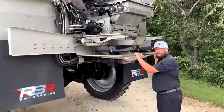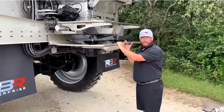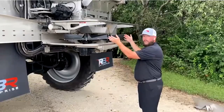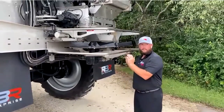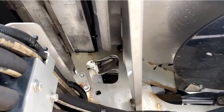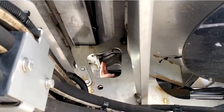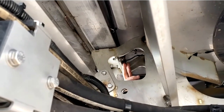One thing with the G5 that is a little different than the G4 is that we do want a certain amount of play in the tolerance on the fan frame. All these pieces are self-centering — you no longer have to go through the squaring process — but we do need about an eighth inch of play on the back end. There are adjustment bolts up and underneath, and these two adjustment bolts on this plate are slotted at an angle to tighten or loosen the tolerance on the G5 spinner frame.